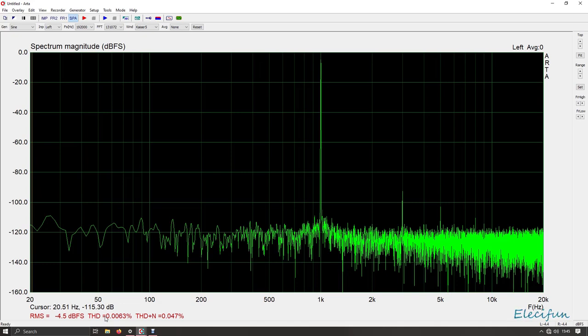Chances are it'll be AC97 drivers as well. And again, you can do this. So the noise floor here, as you can see, we're talking like 120. On the other device I have in my machine, we're down here sort of closer to 140. So there's a 20 dB difference on the actual noise within the system.